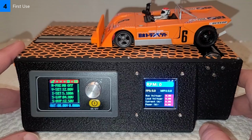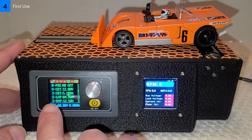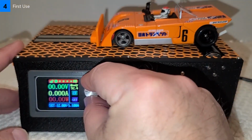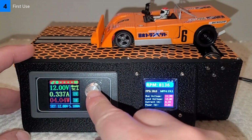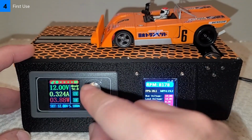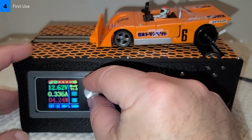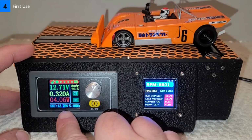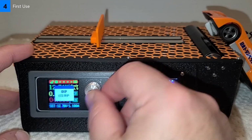Please note that if you are raising the voltage value while the power module is on, it will not initiate the overvoltage protection setting if you go above your OVP overvolt protection threshold, as it considers your active change under operation to be an intentional override of that setting. If you set a voltage value above the OVP threshold when the power module is off, the overvoltage protection threshold will be respected during your next power on.